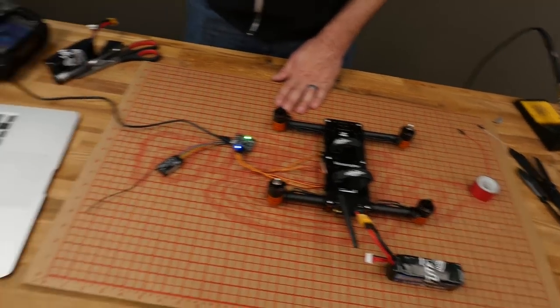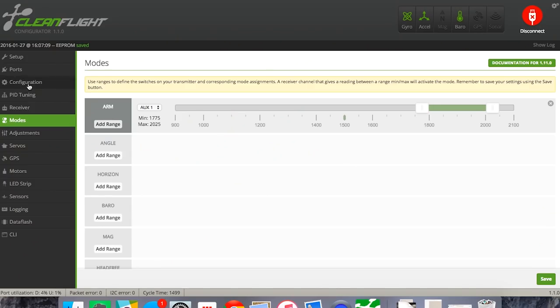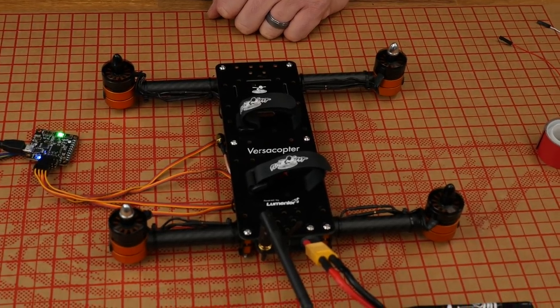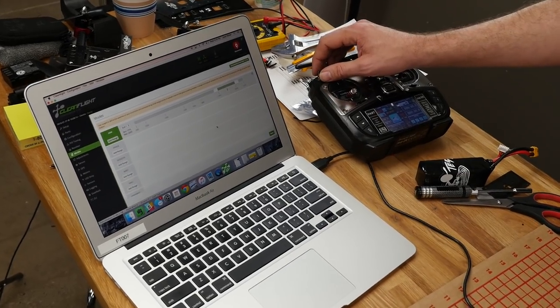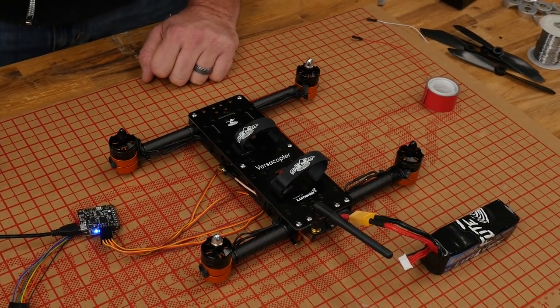Now while talking about arm — this is a really high RPM and I don't want that. To lower it, go back to Configuration and go to minimum throttle. Change it to 1090 and see how it feels. Hit save. Now when I arm it, it's much lower. Adjust minimum throttle further until there's no hopping when you land.